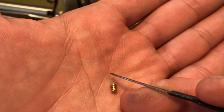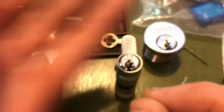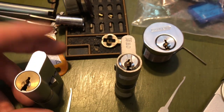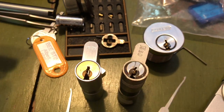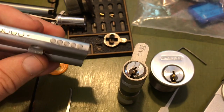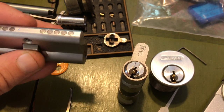Or likewise, he's down in the core and he's hung up. And again, that's going to make the key potentially a lot stickier and things like that. So from a commercial aspect, not quite as ideal. So yeah, I think 6 to 7 pins, if I had to design one, maybe 6 to me is kind of a good sweet spot where the lock doesn't get too big.